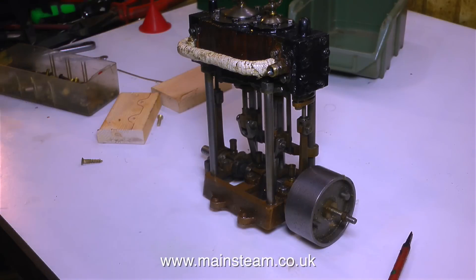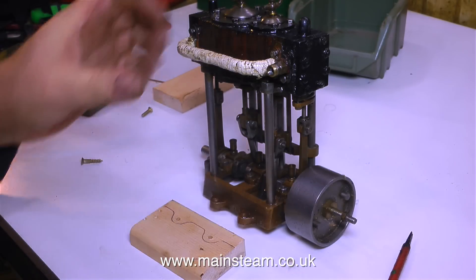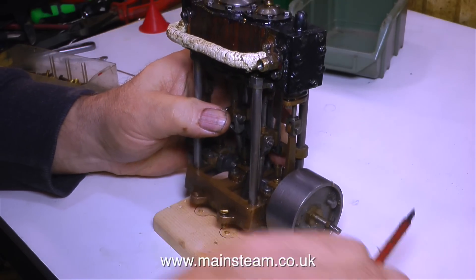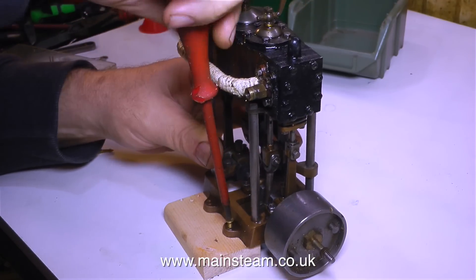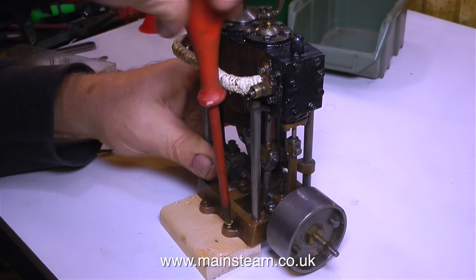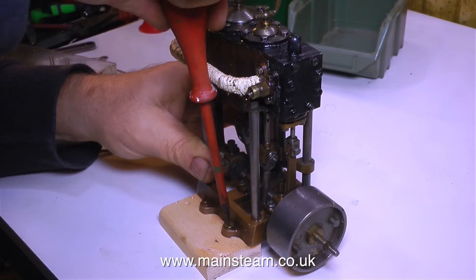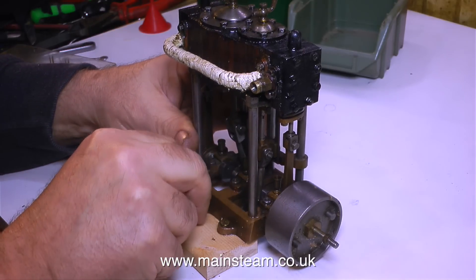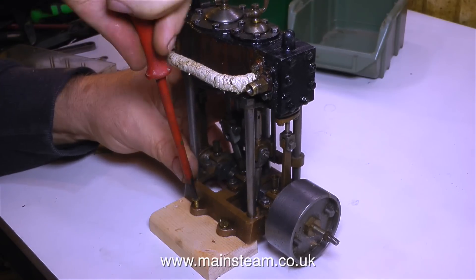Now that the engine's looking a lot cleaner, I'm going to mount it to these two pieces of scrap wood. Mounting the engine is very simple. I just sit the engine on the piece of wood, draw around the shape of the engine's base with a pen, then I also mark on the wood the position of the mounting holes on these lugs. After which I drilled holes 1/8th of an inch diameter into the piece of wood, and screwed in a 4BA bolt. A 4BA bolt will cut its own thread quite easily in a piece of wood if it's a 1/8th of an inch diameter hole. If I was mounting this engine into metal, I would have drilled the hole still with a 1/8th of an inch diameter drill, then used a tap to thread the metal. But as this is soft wood, the 4BA bolt cuts its own thread — I don't need to tap the hole.